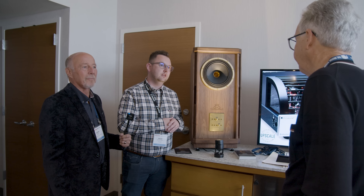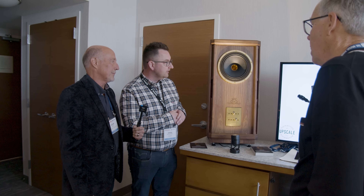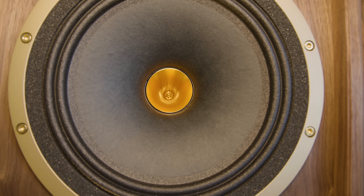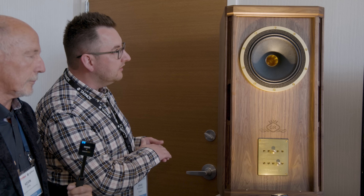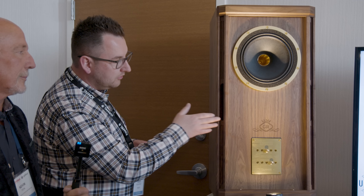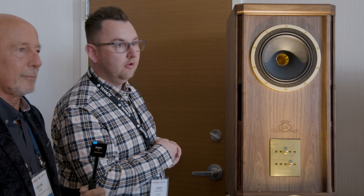They run off the same axis in that respect. We've also taken a lot of care and attention into the porting system. One of the characteristics of the Alnico is that it has a lot more energy than what this cabinet could potentially take, so we've had to change the airflow construction on this model. That took a lot of time and attention for this size product. So this is the porting system here — on the standard Stirling they run from top to bottom, but we've basically had to mill out the cabinet here so that the extra energy is dissipated a lot better and faster.